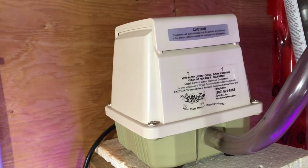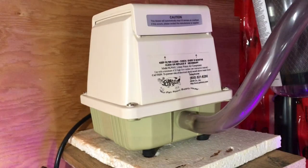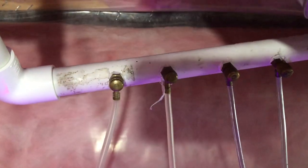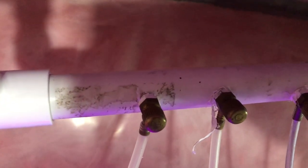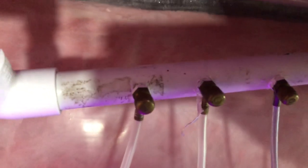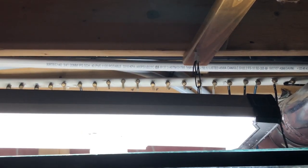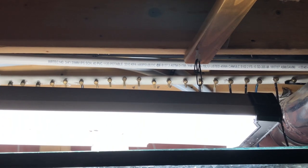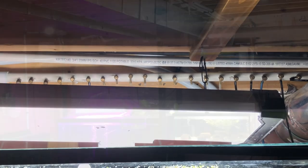I shouldn't ever need an air relief system. This is what all our shutoff valves look like on our manifolds. They're brass shutoff valves, drilled and screwed in with Teflon tape, and they're very airtight — I don't hear any of them leaking. Here's a large gang of them. I was fortunate enough to purchase this pump used, and these manifolds came with it. I modified them to work with the system I wanted to install.